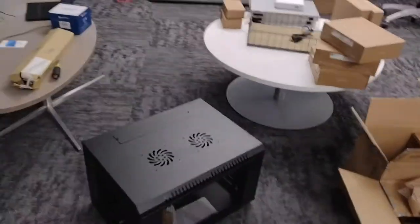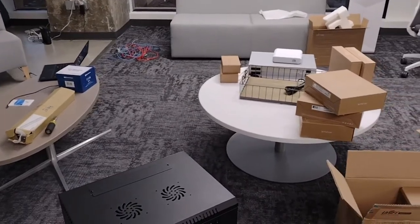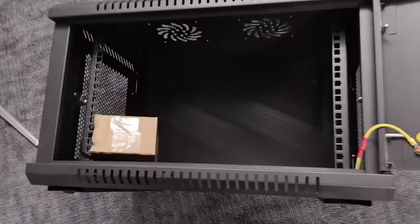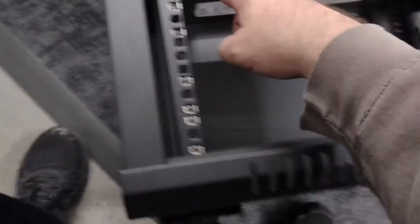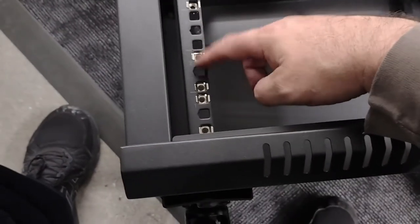The 10-gig stuff is pretty expensive — all PoE. Here's a closer look at the rack. I'm not a big fan of the glass racks — the enclosed sides are actually way louder because you have to put extra fans in there and they don't have any ventilation. I definitely prefer the open grate racks. The way I'm going to rack this: patch panel up top, then the 24-port switch, then the firewall, then a shelf to store the ISP equipment and fiber optic stuff, then a UPS battery backup which I don't have yet.